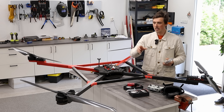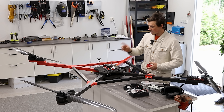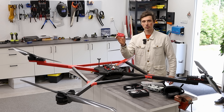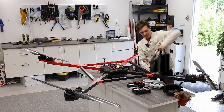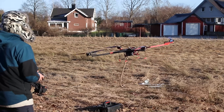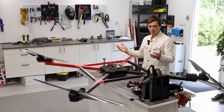I couldn't even begin to tell you all the problems I've had. The final thing that broke was the plywood motor mounts, so I asked PCBWay to make aluminium motor mounts. We're gonna swap them out. I also have a new flight controller — we're actually gonna ditch the Pixhawk. I spoke with some people; they say it's not the best for these type of heavy lift drones. So I got in contact with another guy that had a flight controller. He said it would work perfectly right out of the box, so we're gonna test that out. Now, the sickest upgrade of them all: new batteries. One of the issues was that the drone was too light, which meant the RPMs of the motors was too low to begin to stabilize the drone, which is why it started to oscillate. Heavier batteries will result in longer flight time but also make the drone heavier.